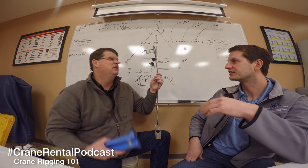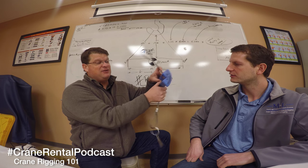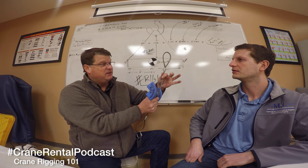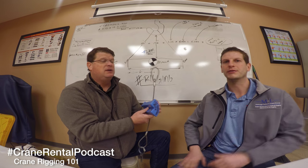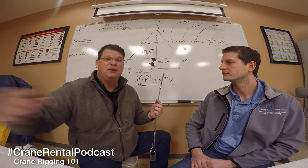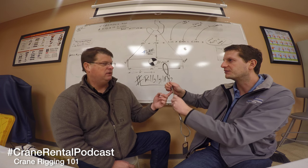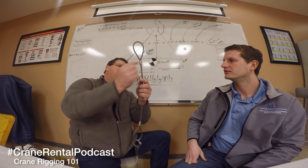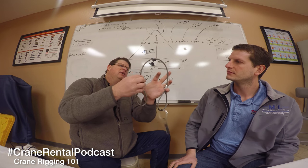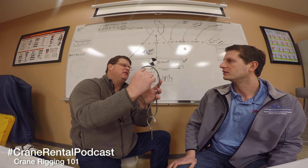That's both an inspection thing and a use thing - how you use it. Based on the diameter I go around and the diameter of the wire rope, I get a reduction in capacity. So if I go around a piece of pipe or 90 degrees around a piece of angle iron, I'm pretty much wrecking my wire rope sling. Because now you've basically jammed that iron into here, cutting it microscopically. If you look at this, bend it over and you can see it's crimped here. The more you bend it, fewer and fewer of these wires carry the load - the bottom's in compression, top is in tension.